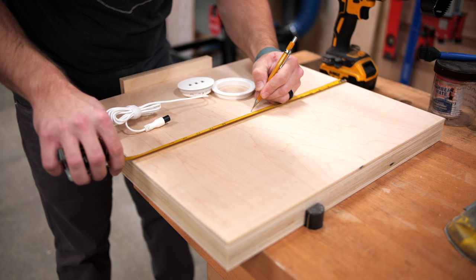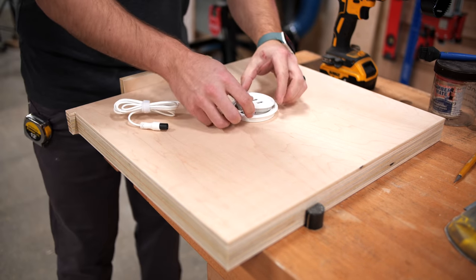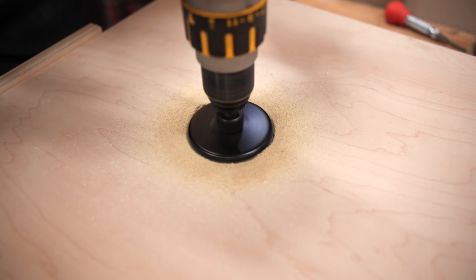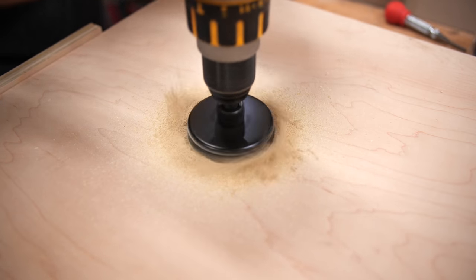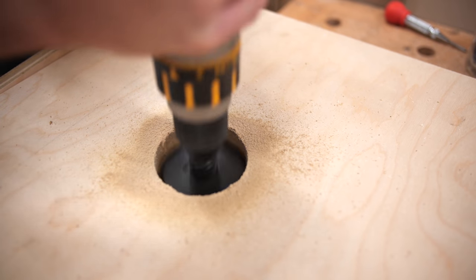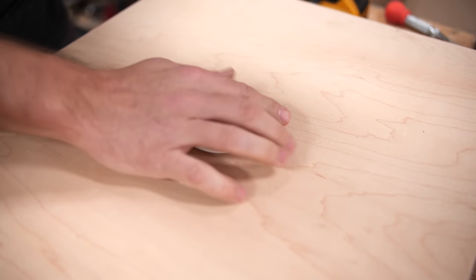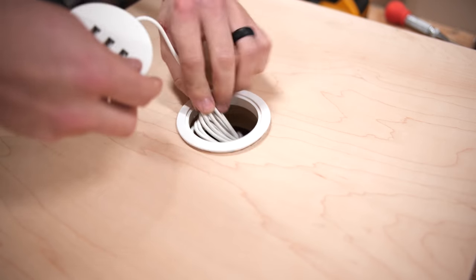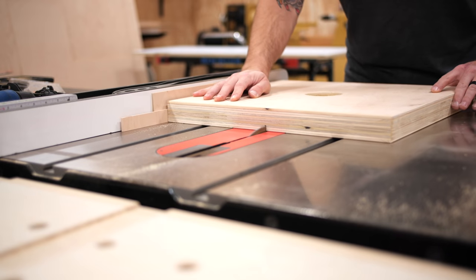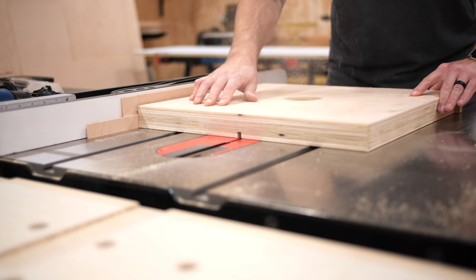This little USB charging puck called the Nordmark is actually from IKEA, and they have some pretty cool built-in electronics including wireless chargers. To install it, I used a specially sized hole saw also from IKEA to drill through the nightstand — drilling from both sides since the nightstand is so thick, using the center bit as a reference point. Once the hole was drilled I knocked off any fuzz with sandpaper and the puck dropped into place with the plastic flange covering the edge. It's a super clean install great for nightstands, end tables, or desks. I then cut a groove in the bottom of the nightstand at the table saw to route the power cable out the back.